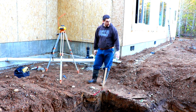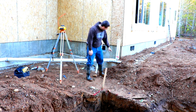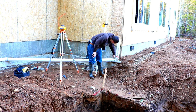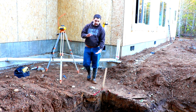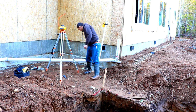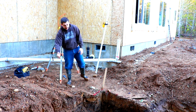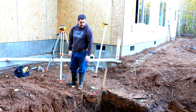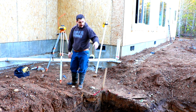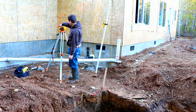We've got a good portion of the hole dug — we're probably two feet into the hard pan. I've got my laser level out. We determined that final grade is this red mark on this pipe right here. We're going to figure out the inlet entrance for the first tank, which will go in the hole right over here. We need a slope from this pipe — it'll kick down, go underneath, and then come across into the 90 end of the tank. We've got to figure out all the measurements so we can get the tank set in the hole, get the plumbing hooked up with the inlet pipe and outlet pipe, and then set the next tank.